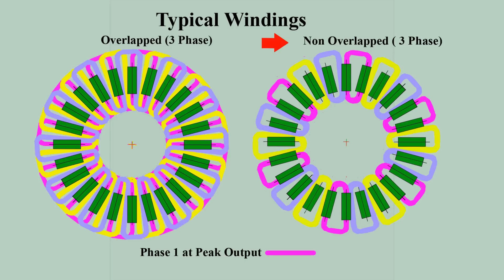Non-overlapped has three coils for each four magnets. Because of this fixed space, any gaps between coils will severely reduce their maximum intercepts with the peak flux, potentially destroying the figure of merit. Pre-wound coils may be used, but they should be as close as possible with limbs centred along radii.